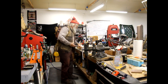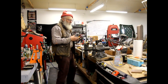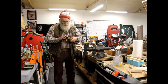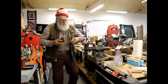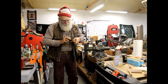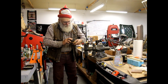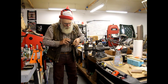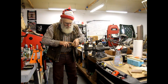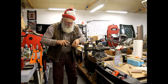The rest can be done with sandpaper. I'm going to get some sandpaper and be careful with the belt sander because you don't want to hit the stock around it — what it'll do is change the shape and sometimes it's hard to fix that. So I get it down close and then level it off to the surface of the stock. That one kind of went right on a bend so I have to make that nail fit that bend. That material is oak, which is strong, and this stock is walnut, so I think when I stain it they'll almost be unnoticeable.